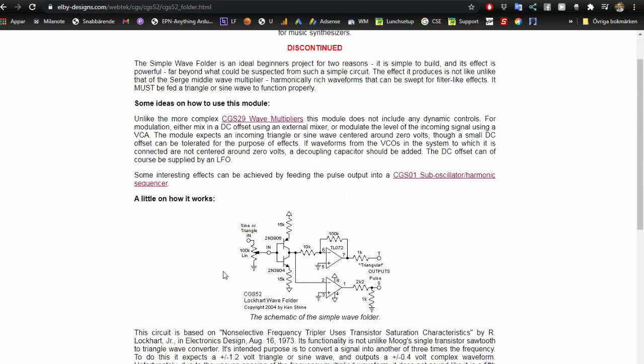There's not much to it. You have the input, an attenuator that actually affects how the wave is folded. It then goes into one PNP transistor and one NPN transistor. I accidentally fried mine here because I forgot these two resistors — don't do that, you get magic smoke. I'm guessing it's because the simpler the circuit, you get more relaxed and you make more mistakes.